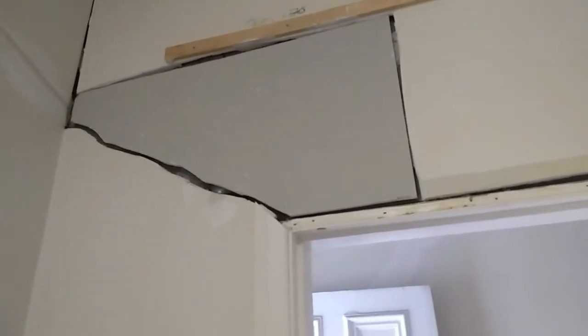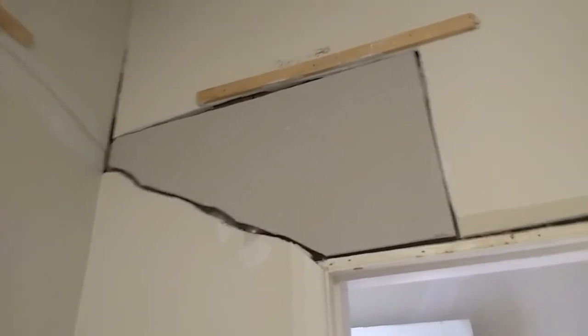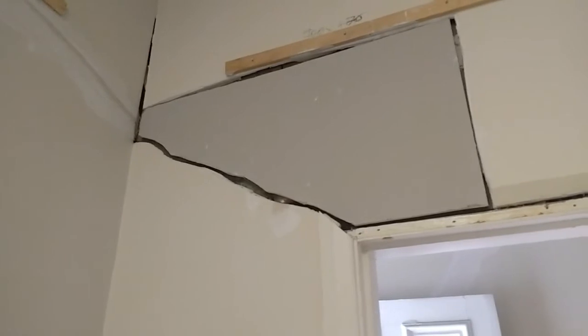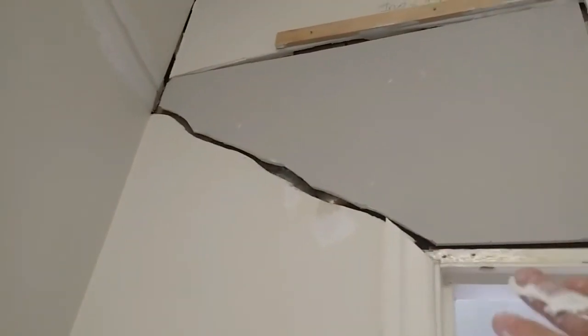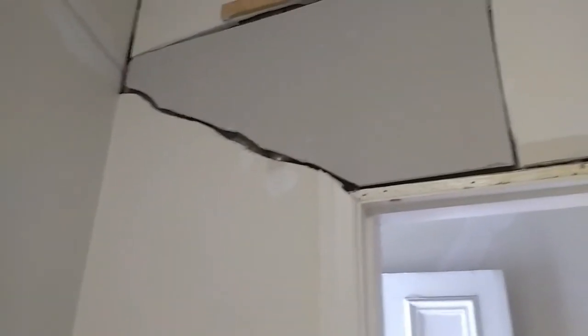You really should pre-fill these gaps before you put the tape on. The best way I've found is not to use actual base coat, because base coat doesn't have good immediate adhesion — it will just drop down and won't stay in those bigger gaps. What I'm using is actually cornice cement, because cornice cement is designed to stick on immediately and it's much tackier than base coat.